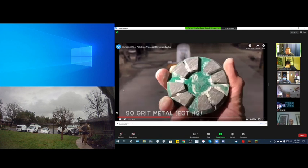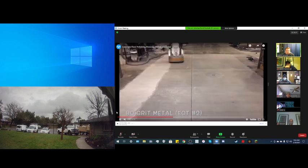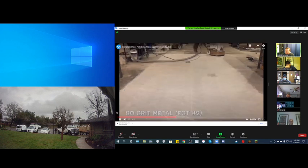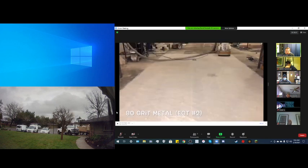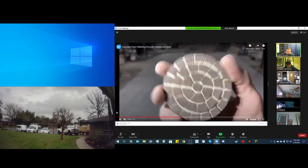All right, so he's using these diamonds on the machine. Now, a much slower process. He's already cut it. Now he's doing a polishing step, and it looks not much different. Again, a lot of that is dust on the floor. He's going to pick that up. And you'll notice it will progressively go up in grits. Now he has a diamond that is, instead of that very aggressive one, there's more diamonds in it, and it begins to polish more. Now he's gone up to 100 grit.